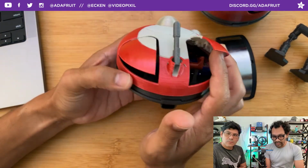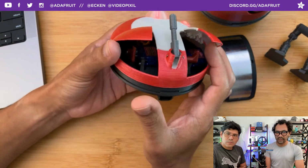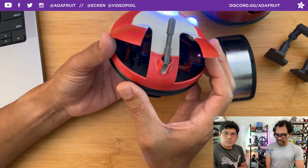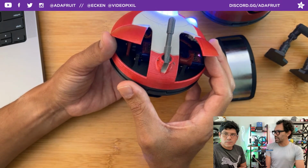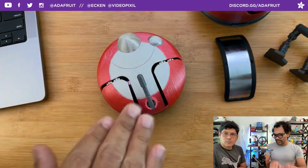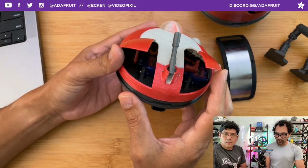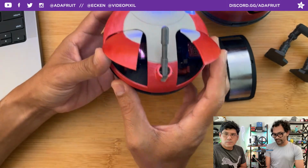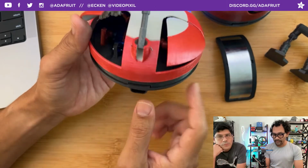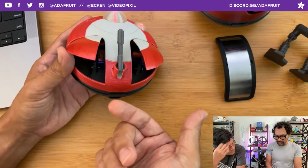On the inside, you can see you have two different servo horns, two different designs because of the way they're mounted. These are just attached to one pin. So I didn't have time to bug Phil B to have two separate servos, one going up, one going down like you kind of see in the show. So I just settled on having one pin control both of the motors, and for that you have to mount them in a certain way so they're both positioning the same way. Yeah, they're not mirrored, it's just positioned equally, meaning one's not flipped over like the other side.